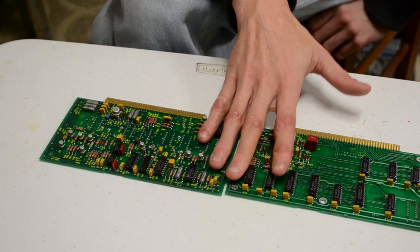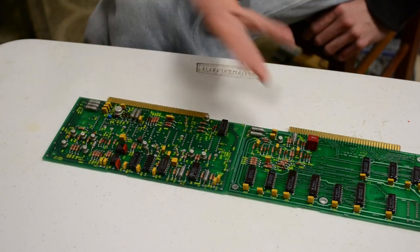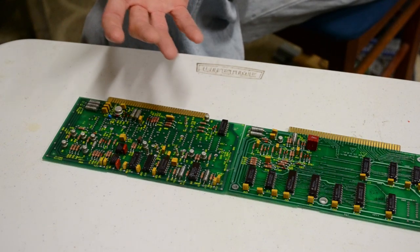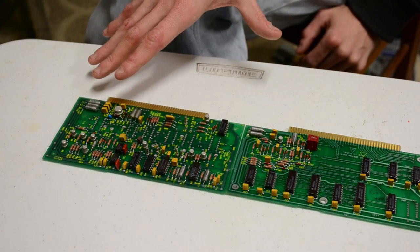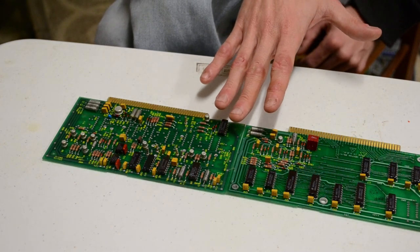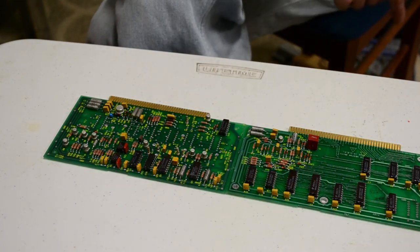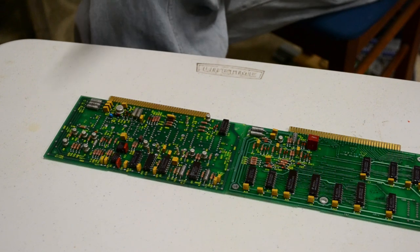These are the cards that deal with talking to the black box to retrieve its data and interrogate it. Interface kind of makes sense. It may also be to do with some programmable inputs on this black box. So some of the inputs aren't necessarily set. Part of the ARINC spec and part of the design of the black box is that you can program some special inputs, which I'll get to. But the other thing interface cards are likely for is that the programmable inputs also take binary. So these could deal with the binary words going straight into the processor with no multiplexing, none of that. They just get put in.